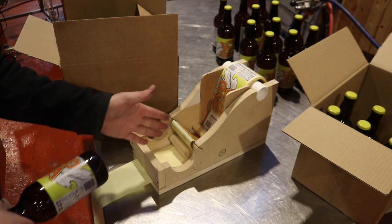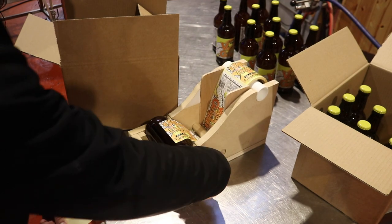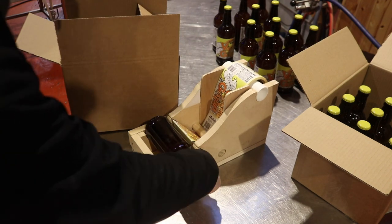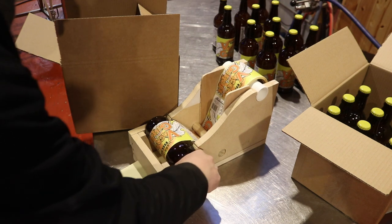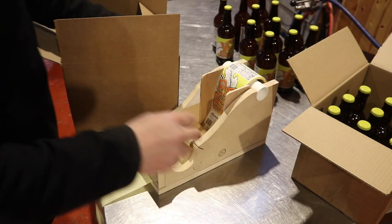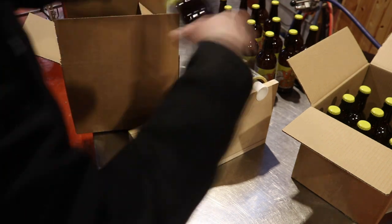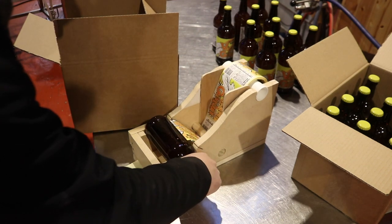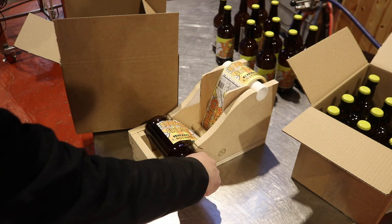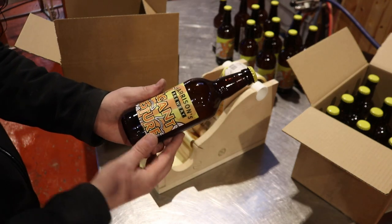like I'm figuring out straight away that if I pull in a direct straight line out of the base of the applicator with the label, then you can see that A, I don't have to flatten the edge on, and B, it keeps the whole roll lined up, so it is gonna go on straight. So there to there, there to there, looking better all the time. So again, you'll see I don't have to rub that edge on, and then by rotating the bottle, what's actually happening is as it touches there, I'm pulling that bottle, and the whole friction in the system on the roll is kind of putting a little bit of pressure on the label, and that's actually enough to cause it to stick down that edge. So there we go.